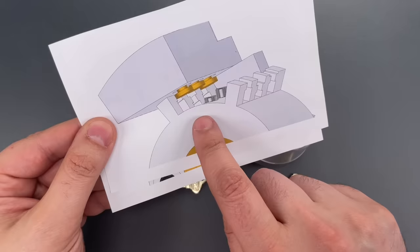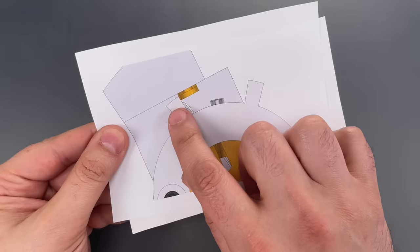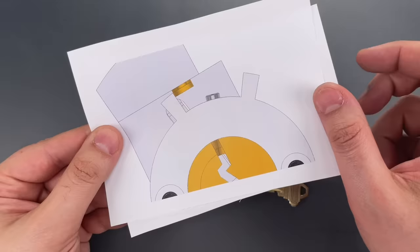Notably, when that test phase occurs — when those upper pins encounter the fins — they are no longer in contact with the key pins. That's what makes this unpickable in theory. What I'm going to do is lift all of the upper pins as far as they will go, lock them in place, rotate them until they're in contact with the fin, and then drop them down until they fall into their gates. It usually takes a few attempts, but the method seems to be reliable.